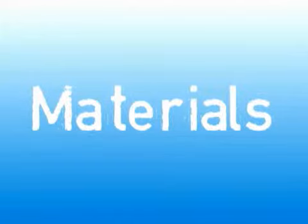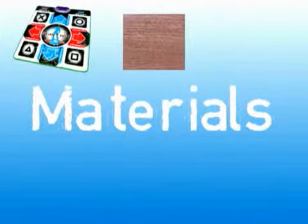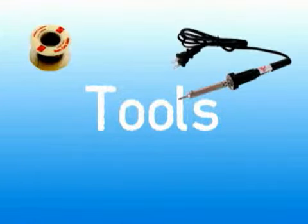I went out and made my own hard DDR pad for just under 50 bucks. Materials include an old cheap crappy DDR pad — not a necessity, you can hack a controller to do the same thing, see episode 4 on how to hack a controller. 36x36 plywood or MDF, half inch would be best. 36x36 plexi or acrylic, an eighth of an inch thick. 36x36 custom printed pad graphic. Screws, aluminum foil, and wire — I personally prefer Cat5.